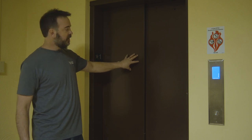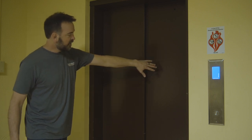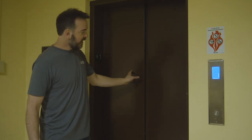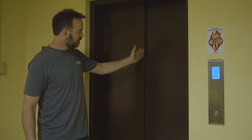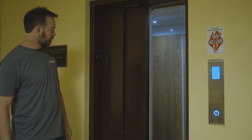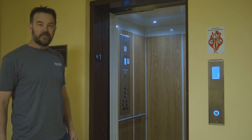The goal here is to have a nice, smooth type of opening where by the time that this door gets over to this point, the high-speed door has caught up to it and they both complete the opening at the same time. And then on the closing, the same thing happens — this one is moving twice the speed, so by the time that this door gets to the middle point, this one will be just closing. So let's go ahead and watch that. So something you've probably seen thousands of times — that's exactly what a two-speed door looks like.